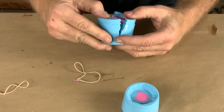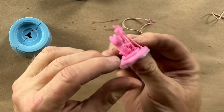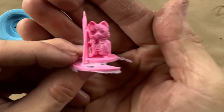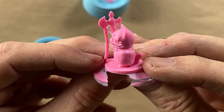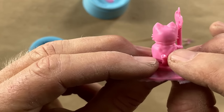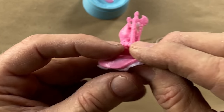Let's open it up and see what we got — let's see if we got a casting here. Let's pull it. Look at that — that's pretty nice. I'm not seeing any bubbles anywhere. A little bubble right there on the tip of the tail — that's pretty easy to fix, but we'll watch out for that in future castings. That's an area that wants to catch a bubble at the bottom. But we got the axe to cast. It's going to be some cleanup, but no big deal — we got it to cast.